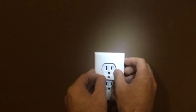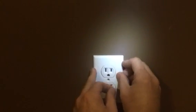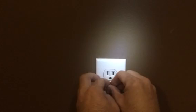You take the foam piece, put it over the outlet, and when you put the plate back on it compresses and seals it, making it almost airtight.